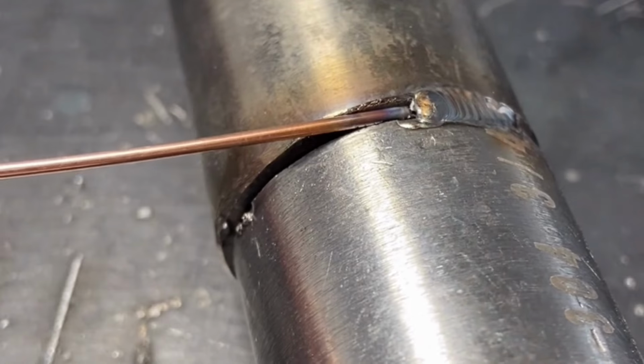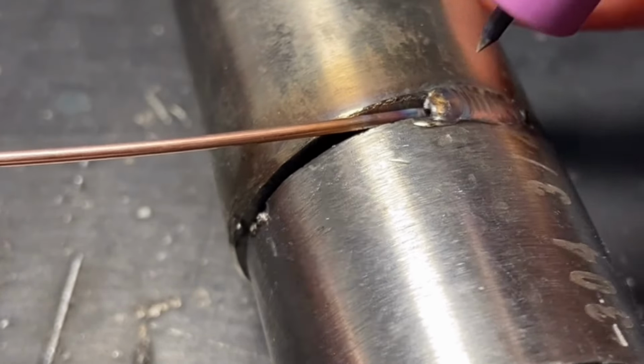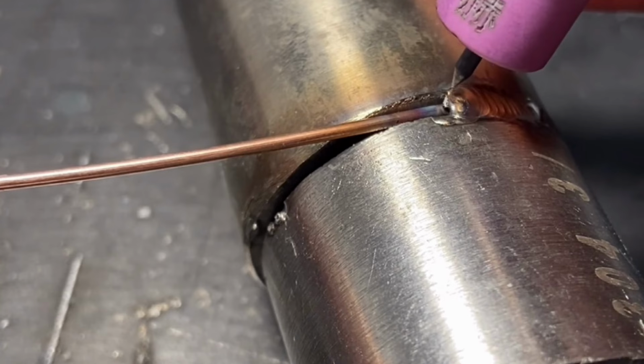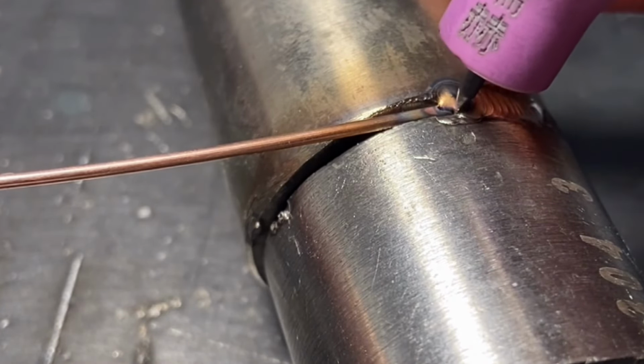If a suitable welding wire cannot be found and the gap is still relatively large, we can use the second welding method, swing welding. The first welding point is welded to the upper part of the workpiece, and the second welding point is welded to the lower part of the workpiece, so that a beautiful weld bead can also be successfully welded.